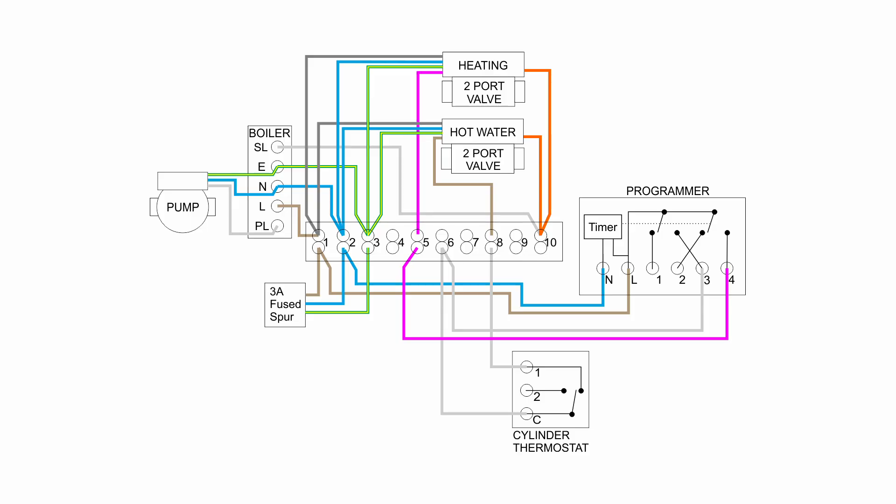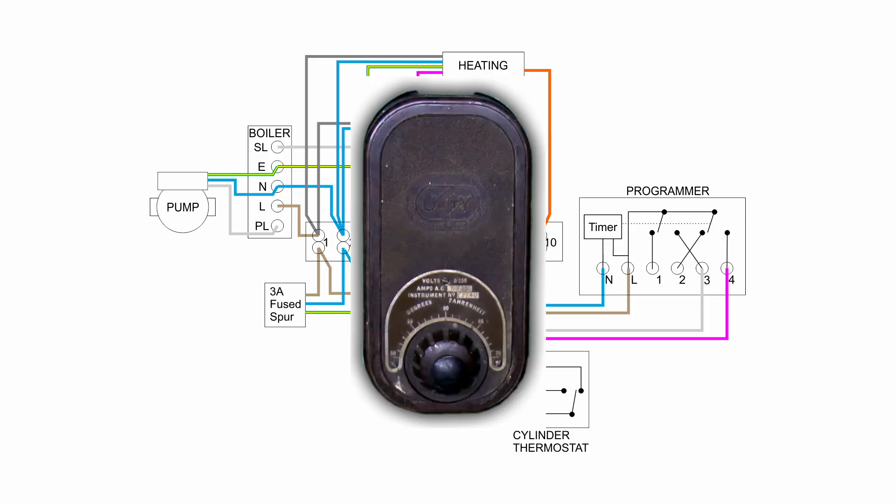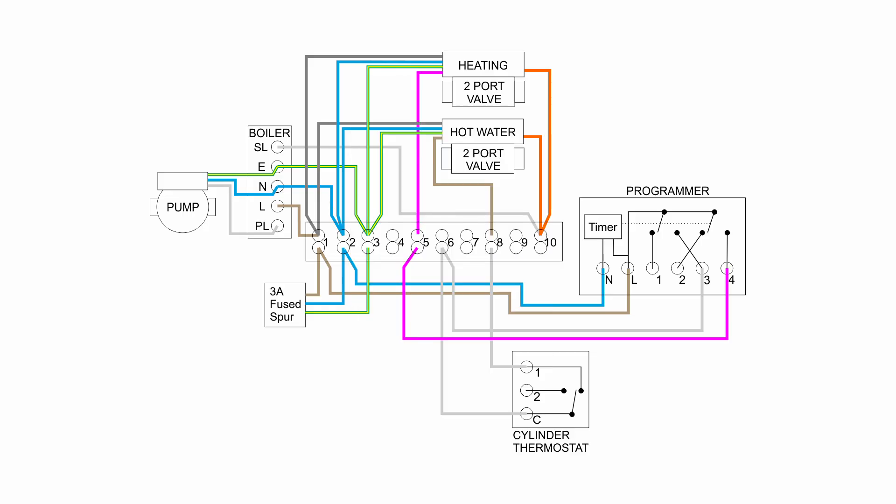Now if you really couldn't be bothered, you could in theory just go to the existing old thermostat, set it to the maximum temperature, and superglue the knob in place — and yes, the system would work, but that's a horrible bodge. By putting that link in you're essentially saying the old thermostat would be turned on permanently all the time. When you've finished, all you end up with is essentially the same components — the only thing you've changed is that the programmer is now your Nest or Hive box. The wiring to it is the same as the previous item, and you've made that minor adjustment inside the wiring terminals so that rather than going via the wall thermostat, the heating now goes directly to the two-port valve. The cylinder thermostat, boiler connection, pump — no change to any of that.